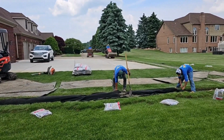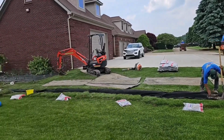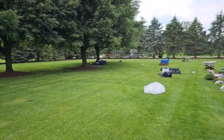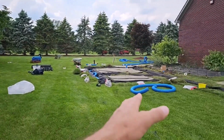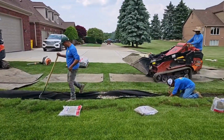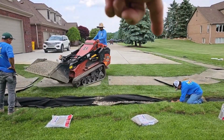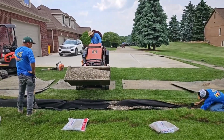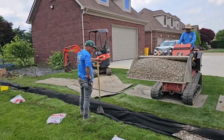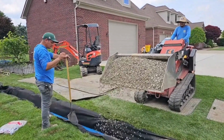It's no big deal. Even houses on hills, because this house has got real good elevation. There's this rolling land, and you end up on rolling land with these little pockets where the water on these big properties gets trapped. We got a hill over here, so the water can't get out the side lot. The grade goes up towards the ditch, but you don't want to take down the ditch bank because you don't want the ditch water to flood your yard. So you got to be careful what you do.